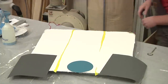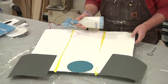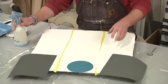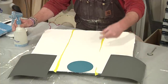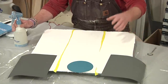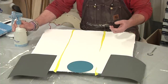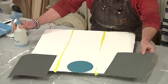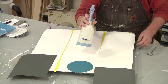I'm going to be wet sanding these down, I've just got a little spray bottle here. If you're going to be sanding gel coat — whether you're doing a repair or just have some deeper scuffs — it's better to use a spray bottle than to dip your paper into a bucket. Because what happens is you sand, you load up your paper, you dip it back into the bucket, and now you've washed all that stuff into the water. That water is supposed to be clean, so when you get to your finer grit you might accidentally pick up a speck of sand and basically sand 80 grit marks into your hull — which is no good. So use a spray bottle, and for a little extra lubrication I like to put some Dawn dish soap in there.